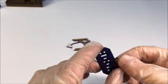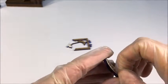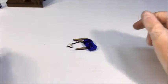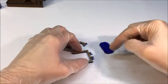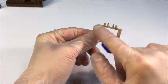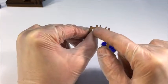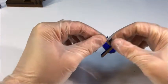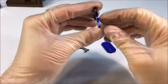So again, here's the other side. I'm just going to break it off and snap it off — and it gave me a little piece here to grab hold of, and then the paper will just come with it. So I can do it with the gloves on without a problem, and again I don't have to be grabbing for an edge. You saw in that case that the B protrusions were back to back, but sometimes they are in different places. So you always want to be carefully paying attention — you don't want to break off any of these pins that are actually needed for assembly. Always look for the B-shaped protrusions.